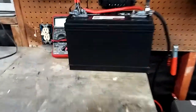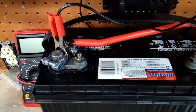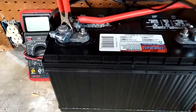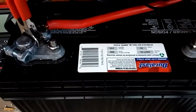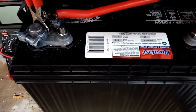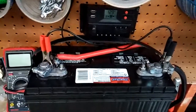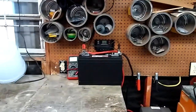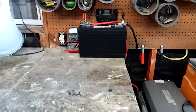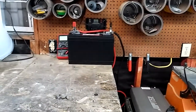That is a marine battery by the way - it's a 290 PDL and they told me it was 106 amp hours. I looked it up online and that's what it says, but I'm a little confused because it's got a 210 reserve capacity. With the 25 amp mathematical equation it seems like it's around 80 plus amp hours. But anyway, for a hundred bucks I think it's worth it - you can get a few of them, get one a month or something. Well, there you go, that's mine. Thanks for watching.